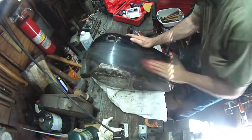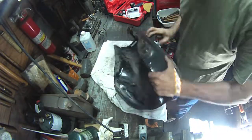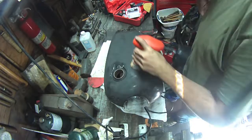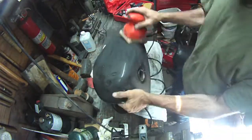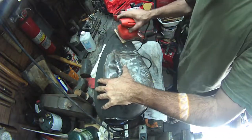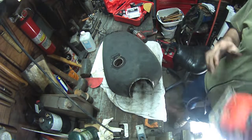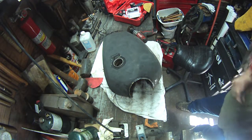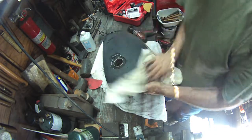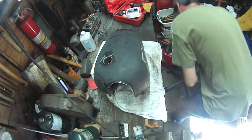I'm going to sand this entire tank down because I'm planning on painting the entire tank. Do a little bit of hand sanding because some of these curves and bends are a little tricky for a flat sander. I do get a palm sander in here to make sure I've got a good bite because there's a lot of paint on this tank — there's bondo on this tank from the previous owner. I got it at a tow yard auction. In the next video I take a two-part epoxy — plumber's epoxy rated for gasoline — and go over the entire weld to make sure there's no pinholes. I'm pretty confident the weld is tight; I didn't pressure test the tank because I knew I was going to do this gasoline-rated two-part epoxy anyway.